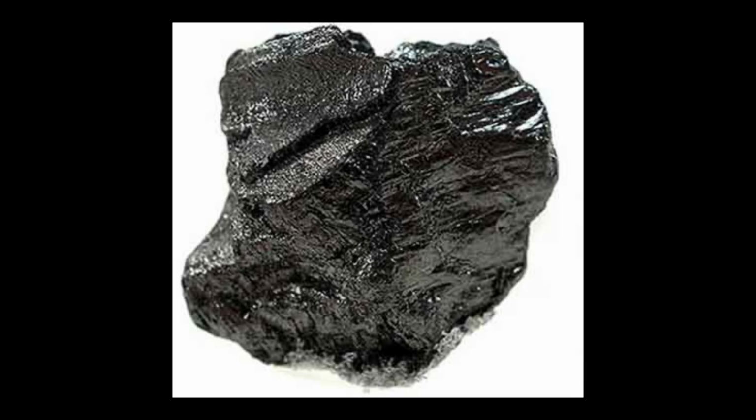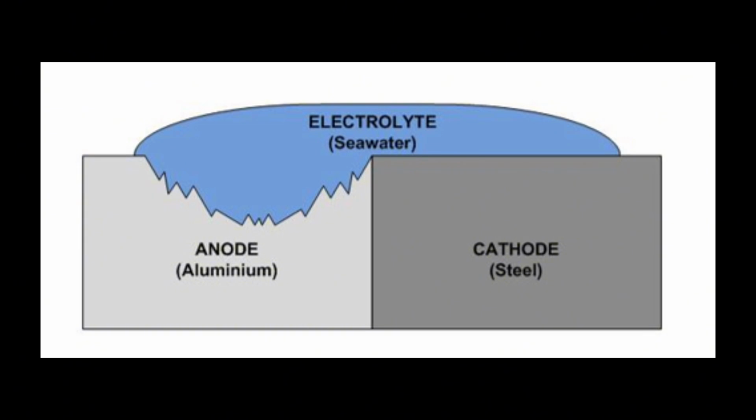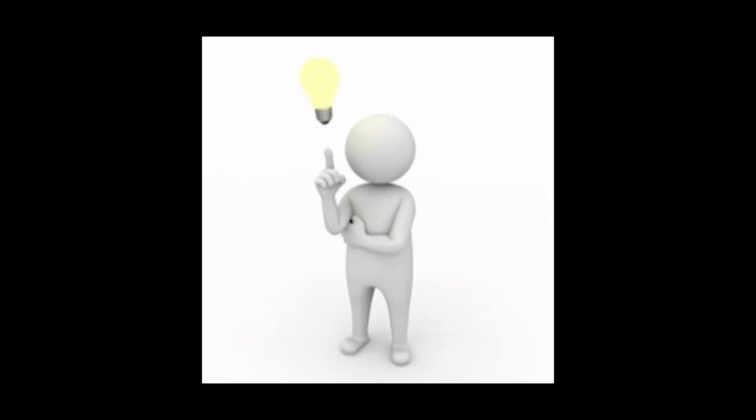This steel ideally has a composition of about 0.1% carbon and 10% chromium to really bolster that corrosion resistance against the salt water, effectively making up for that which we have lost by moving down the galvanic series. And with that, our ideal steel alloy has been formed.